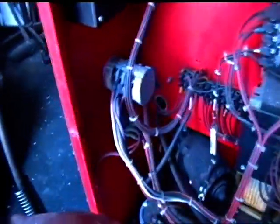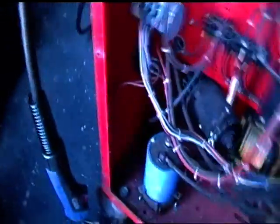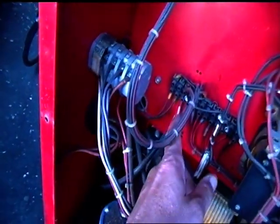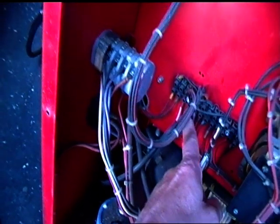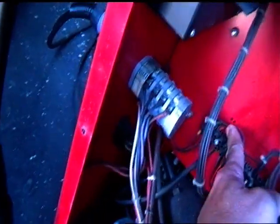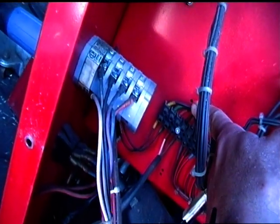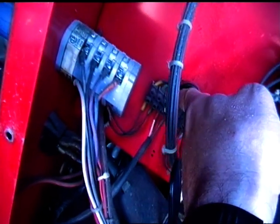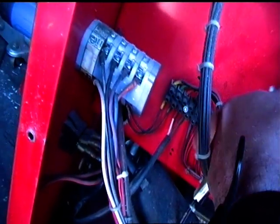divert the 12 volt feed, and I know it's 12 volts because I've tested it with a little multimeter. Yeah, really expensive multimeter. This cost me all of about £4. You can also look in here and you can generally get a bit of an idea about which one will be the live by the colours. Now you think that one's white and that one's sort of reddy brown, so you think, okay, the reddy brown must be the live, but actually it's not. If you look on the other side, the wires which feed in at the top of that block, the red wire or red insulation goes to the white wire below, and the black wire goes to the reddy brown wire below. You follow?